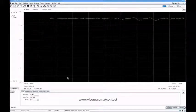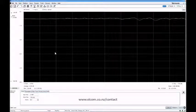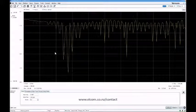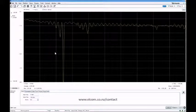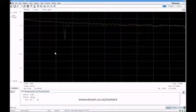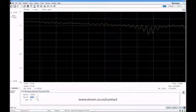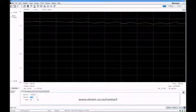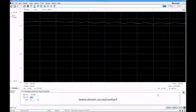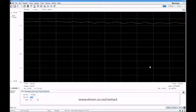Of course my antenna I have is not that good, so this is from the beginning. So we'll add a little bit of a cable. This should be pretty good cable, and let's see what we can do for measurements. Oh, if I just get it really tight here. So we're in here, and the test that we're going to do is between 1 gig and 3 gig. Immediately we get some readouts of the max and the min and the slope. You can see that this cable between 1 and 3 is pretty good.